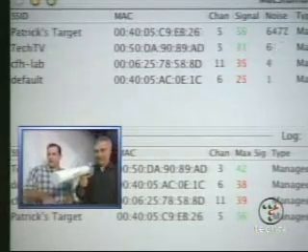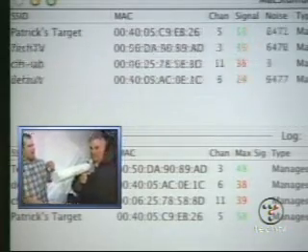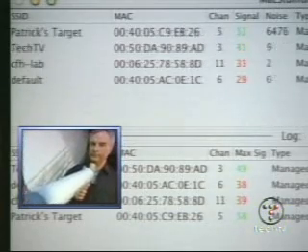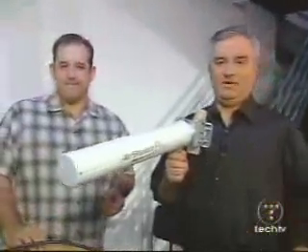The signal should jump up a little bit higher again — it's really going now, it's 57, 58. Every three decibels you go up is essentially a doubling in strength — it's logarithmic. This can get you in trouble with the FCC. If they show up at your house saying you used an improper, illegal combination of a non-approved antenna with an 802.11 card, don't call us.